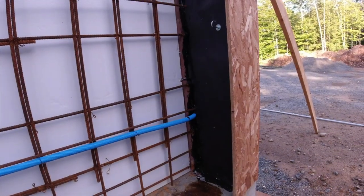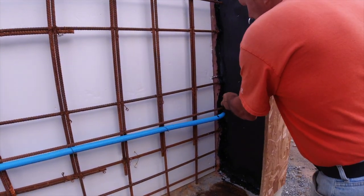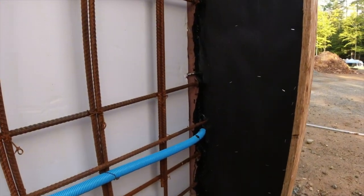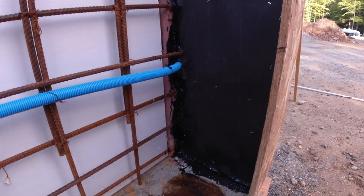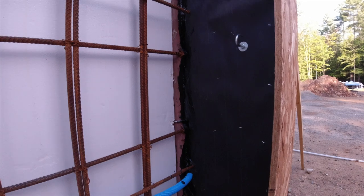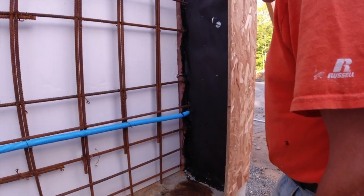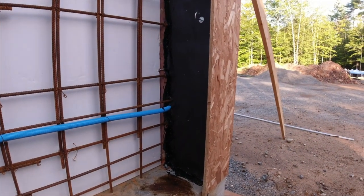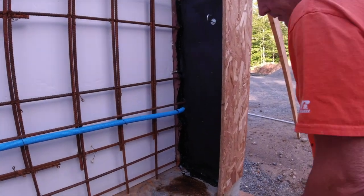Go ahead, touch it. Not sure I want to. Well, actually, that's nice. It dried up good? Yeah. Awesome, just enough for waterproofing, before we spray it up with the ShotCrete. There were a lot of spots where the wood was still exposed, so we really wanted to make sure we had a tight seal here because the wood didn't exactly touch that metal. Right, and it was hard to get the felt in there with the U-bolts and whatnot. So this is going to make it more waterproof? Yeah, I guess waterproof.